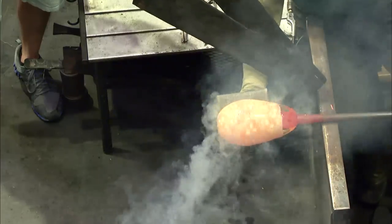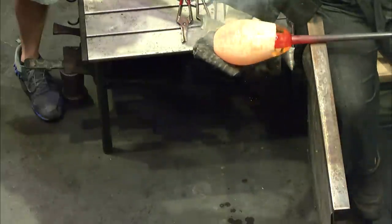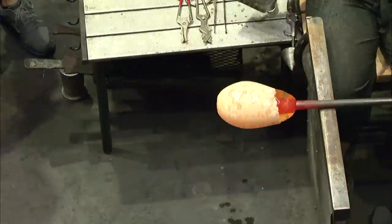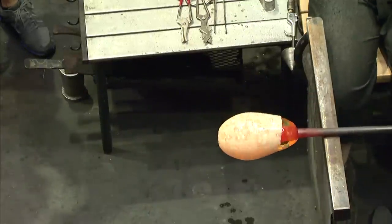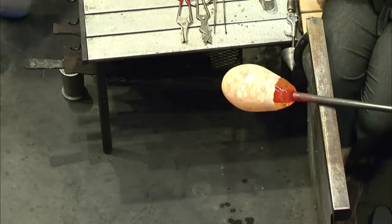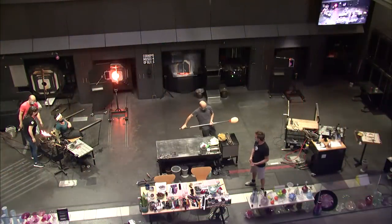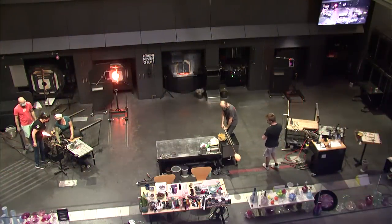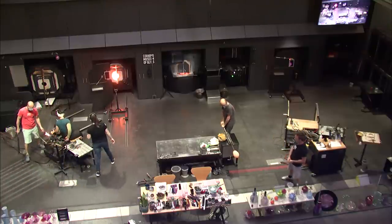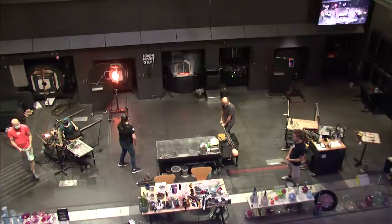But you could mix the raw ingredients. A lot of places do, the silica sand, the soda ash, and limestone. But we like to use cullet because it's really clean. It's dust-free. You don't have to worry about mixing and shoveling all the silica dust into that oven. And the cullet, the glass, when it's already been melted, has gone through the process of converting to glass. So there's a lot of energy that goes into making it into glass for the first time from the silica. A lot of time, too. So once it's already gone through that process, it's much, much quicker, a lot easier, and easier to handle, really.